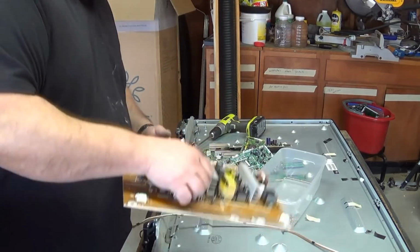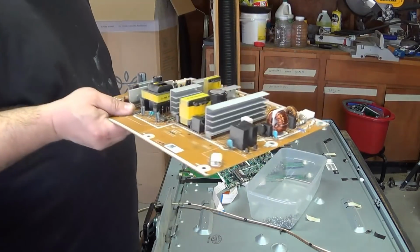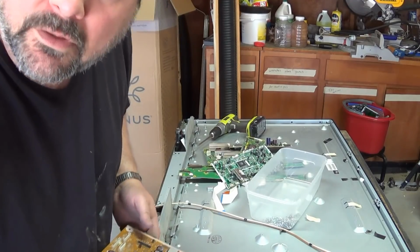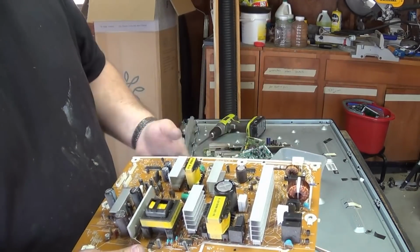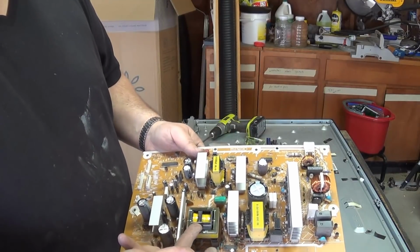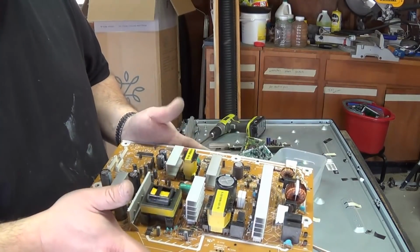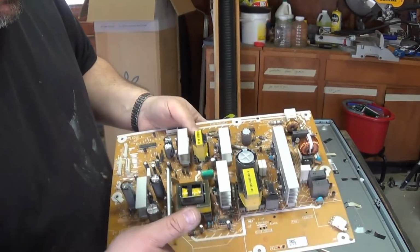All right, and the last board is, I think, another power board, or the power board. Again, check out your scrapyard and their prices, what they pay for things. You want to make sure that you're getting the best value for your weight. The three main things in here that you want to look at are the price of low-grade boards, the price of aluminum, and the price of transformers. If any of those are higher than the others, take them off and sell them separately, except if for some reason they're paying more for power boards than the other two things, then leave it all together.